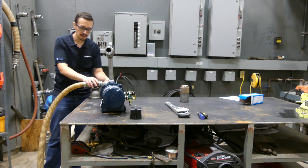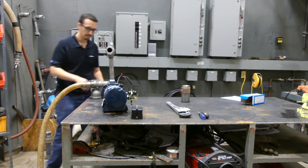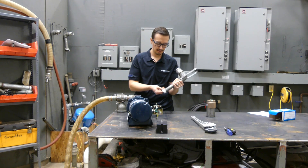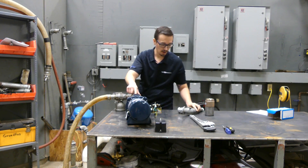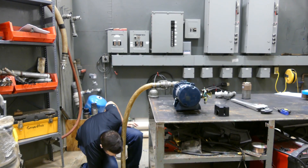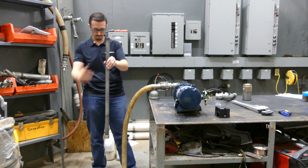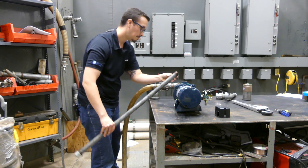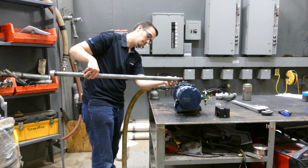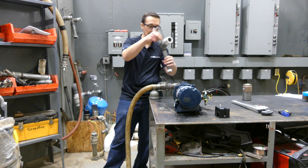We've got the suction line completely filled with water. We hooked it up and just had to prop it up on this bell reducer to keep it from wobbling. Now before we put the discharge in, we're going to pour some water directly into the pump to make sure it's completely primed. Using our high-tech pitcher filling device, we fill this thing up and dump the water right into the pump — just fill it until it's completely full to make life easier.